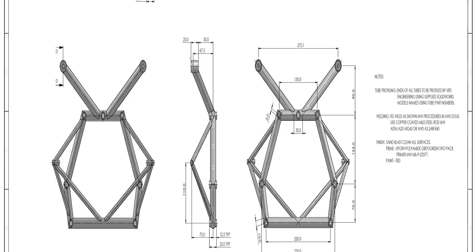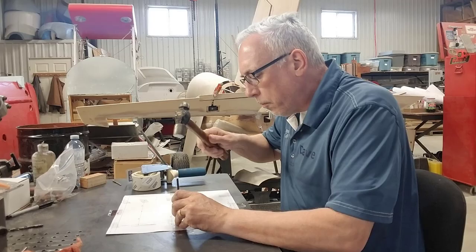They manufacture the parts, and we receive those parts back. In the meantime, we also wanted to design a weld jig to weld these components together. During the welding process, parts get pulled here and there because of the cooling of the metals. It's really important to have everything locked down as best as you can in a weld jig, so that when you weld it together and you pull it out of the jig, everything's going to align like you want.